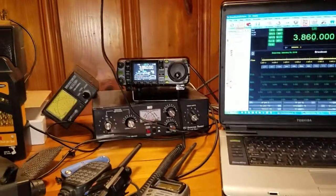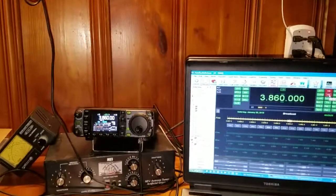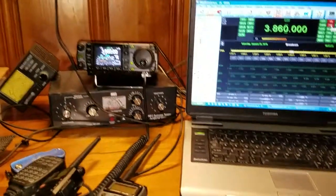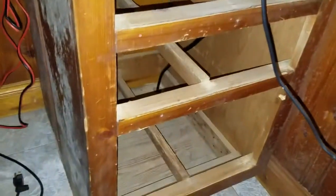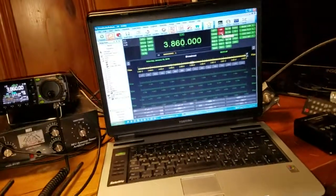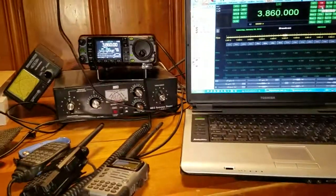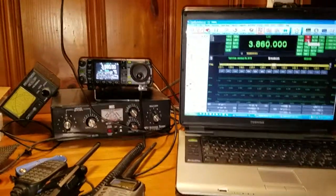I've rewired the outlet up there for GFCI — it was a two-pronger. I still need to run some ground wire. I put my lightning protection up to protect the unit. I'm going to go down into the basement and run the ground wire — I think it's number 10 or 12 — and drive some grounding rods down there for the RF system, keeping everything individual so we don't have a ground loop.